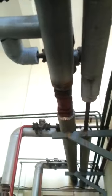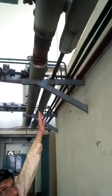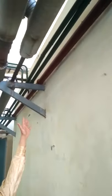The suction line is connected to the insulated pipeline, and the discharge line is connected to the red colored line near the wall. These two lines handle suction and discharge respectively. The suction line collects vapor ammonia from all the evaporators in the plant, and the discharge line carries compressed ammonia to the condenser.